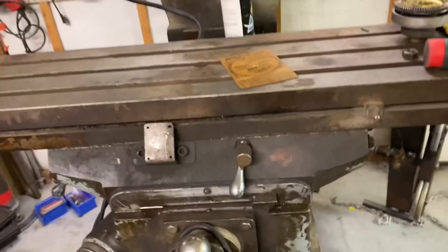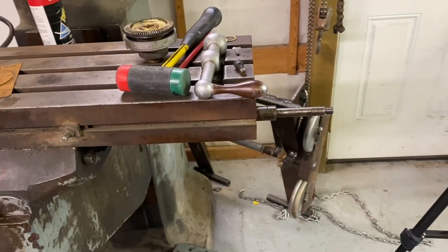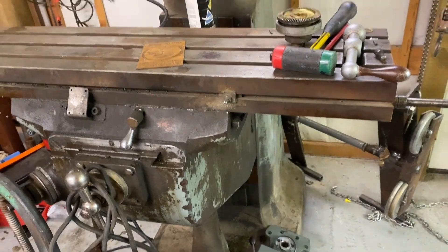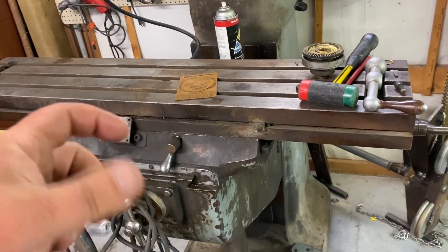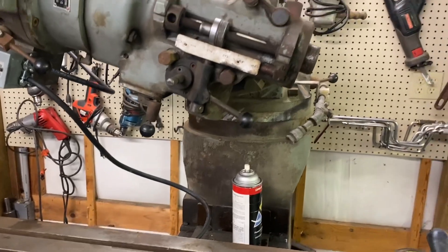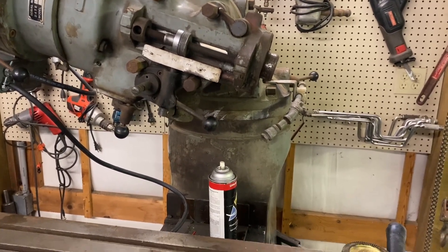Hi, this is Adam from Small Town Machine Shop. Tonight's plan, in between cleaning the shop, is I need to get the lead screw out of this so I can cut the keyway for the handle. My plan is to remove the lead screw and then cut it with this machine. I have a very heavy-duty XY vise with hand cranks on it — it's just a keyway for a handle, it'll be plenty accurate. So we'll get this thing out and have it cut the keyway for its own lead screw.